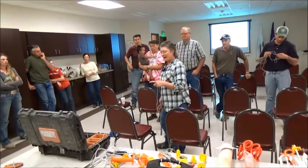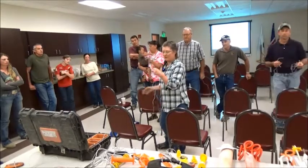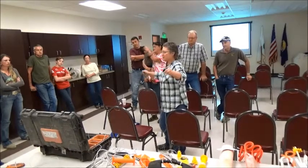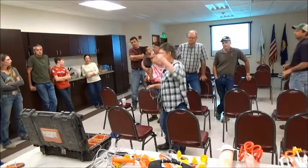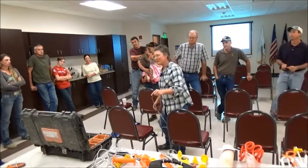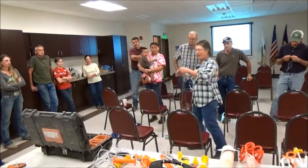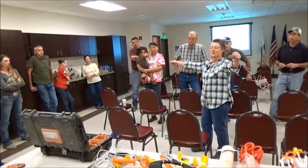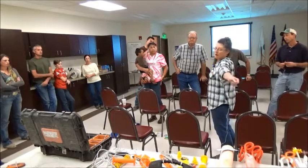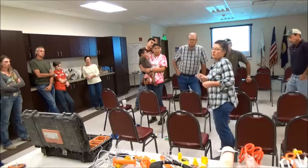When a fence goes down, and this is the thing about checking the fence when your fence charge changes, somebody's going to chew on it. And then when you get the fence back up, you have to test the fence close to the charger and at the other end. Because what will happen is it'll be hot at the charger because this is all really great fence. And then it'll hit a little intersection of chewed up twine, which you won't know about because you didn't walk the whole thing and check for bad twine. And it'll all be good at the end. So you'll think it's just fine.